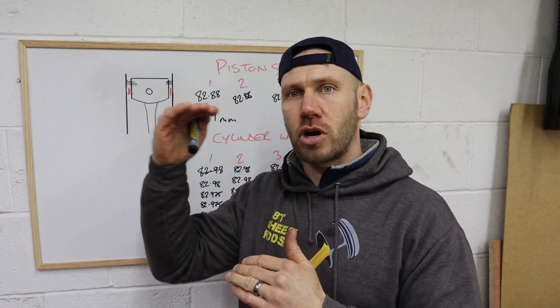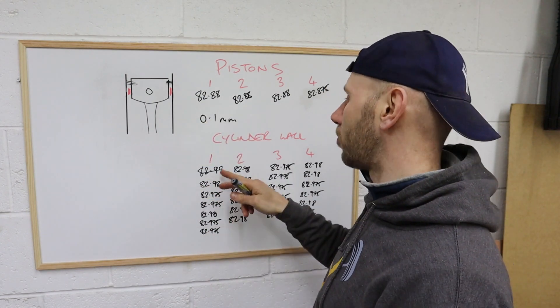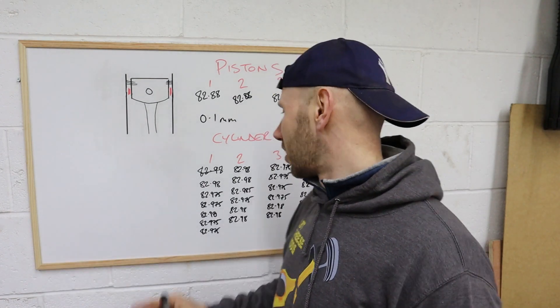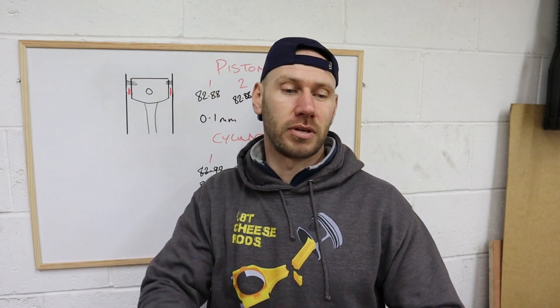The cylinders are now measured. I measured at the top, middle, and bottom of each cylinder in a few different orientations, so I've got loads of measurements. For my 82.88mm pistons with 0.1mm piston-to-wall clearance I should get 82.98mm, and I'm getting 82.98 all day — some readings of 82.975, one of 82.985. That doesn't mean the bores are wonky; it just means there's a small transfer error from the internal mic and gauge to the micrometer. If they were way off — like 82.97 or 82.99 — I'd re-measure, but they're just a fraction off. Piston-to-wall clearance: 4 thou, 0.1 of a millimetre. Works out mint.